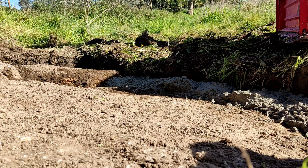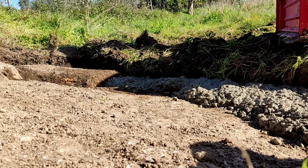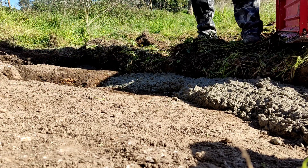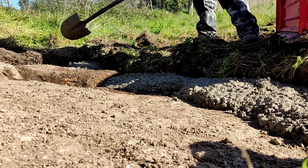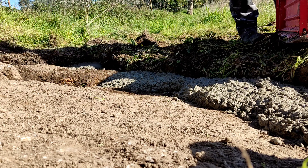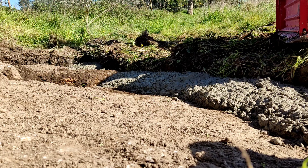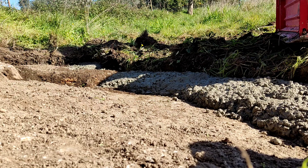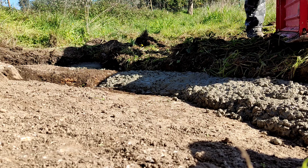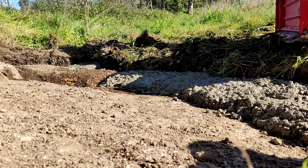While I'm putting this concrete in here — these foundations are on top of solid granite by the way — I think I need to tell you the reason why I use four to one and not what everyone else on the internet recommends, which is five to one. Because I think three gravel, two sand and one cement leaves the mix what they call too bony. By bony I mean it just looks like there's too much stone in it and not enough sand to bind it all together. So I'd recommend two gravel, two sand, one cement. Mix it well and you'll find it's very workable and it provides a really strong concrete at the end.